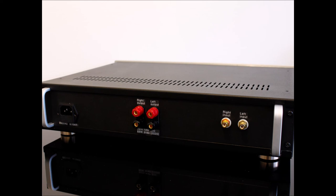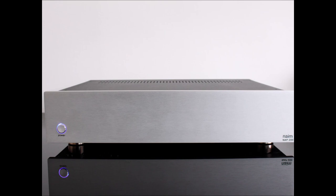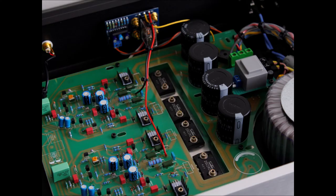So, to sum up, it's actually quite incredible how such a low bias amplifier can still sound very snappy and dynamic. Even better, it makes the amplifier quite efficient in terms of power consumption, and relatively little cooling is needed. However, what I did do is add a 5mm thick aluminum sheet that I cut with a miter saw, copied from the original PCB, and I added it as extra cooling. Also positive is that it stiffens the cabinet a little bit more. So I hope you like this video, and I'm very curious what you think about this amplifier.